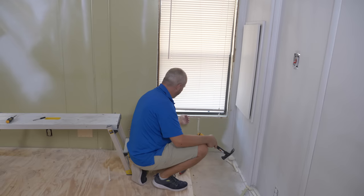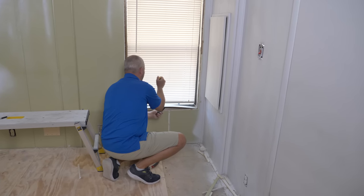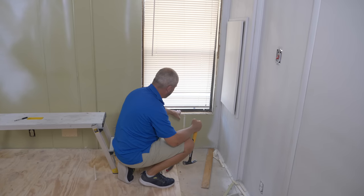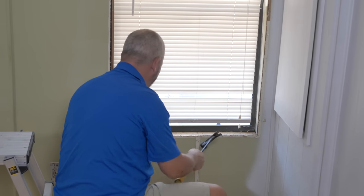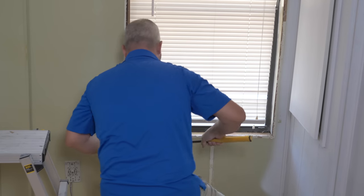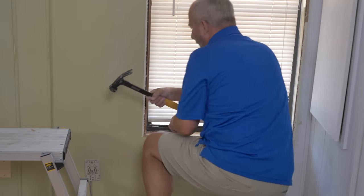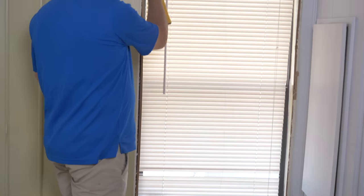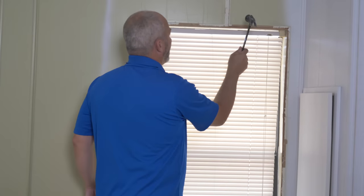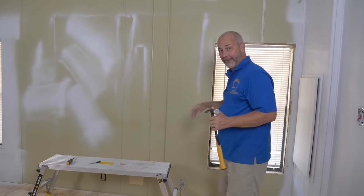Because of the way I'm finishing here, I'm going to be putting in a different trim all the way around these windows. We're going to put in some half-inch pine and then have actual window casings. For me, I just want to make sure all these nails are hammered in nice and flush. Finish prepping your surface before you move forward while your tools are in your hand — don't go 'oh, I'll get that later,' it'll drive you nuts.